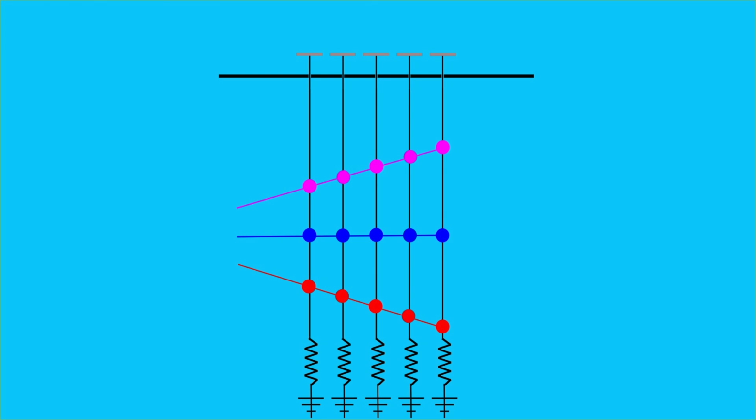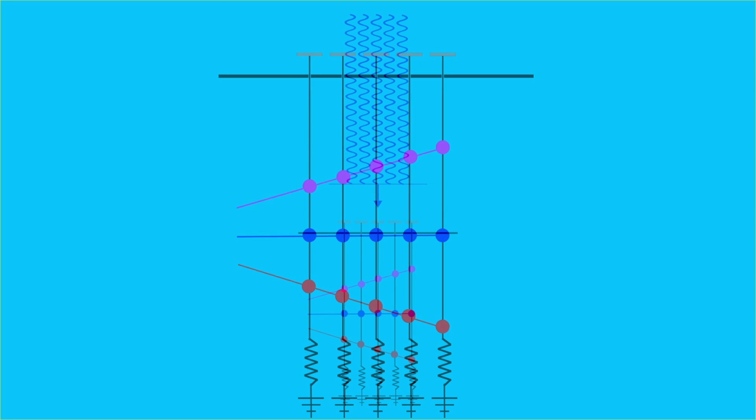The dipoles have wires that pass through the reflective metal backplane and all the way down to those squiggly little things near the bottom. Those act to make sure the current flows properly down the wire. Those colored circles are directional couplers. They steer the signals coming down the wires to an amplifier so that the signals can be detected.